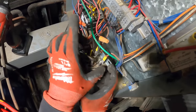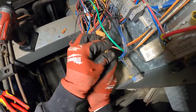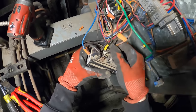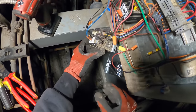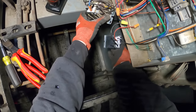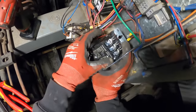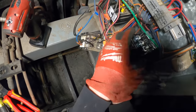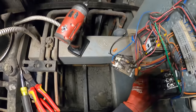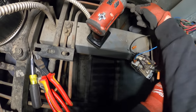Make sure you see where this stuff goes — that's the coil. I can put that there, mount the new contactor in place, and go wire for wire. That's going to make things a lot easier for sure.